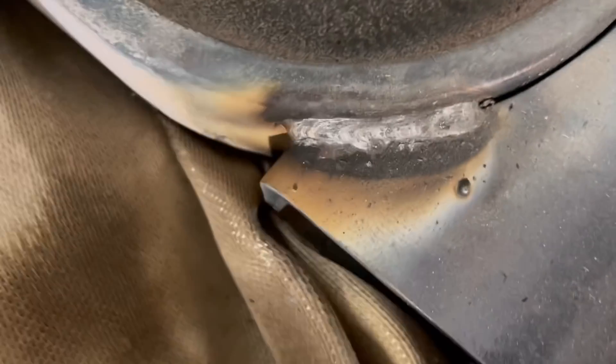It's been about three or four hours — let's see what we got. Oh wow, pretty good, pretty impressive. I'm happy with that. This is one of the most difficult welds I've ever made. What I've learned is that you can join cast iron to mild steel using Nickel 55 rod. I heard you could use Nickel 99, which is 99% nickel and works even better, but that's twice as expensive — and at $59 a pack for the 55, I'm going to stick with the 55. This is all going to be a stand, just to give it a place to stand so my customer can use it for his project.